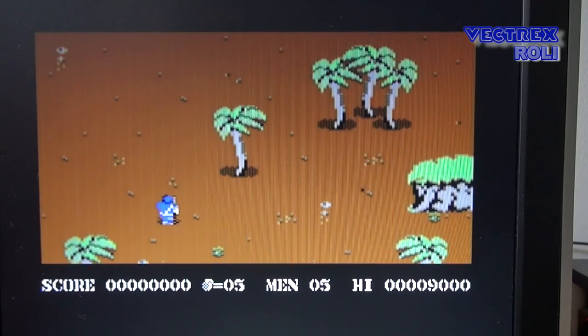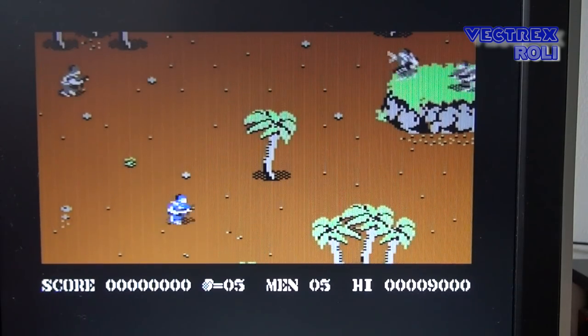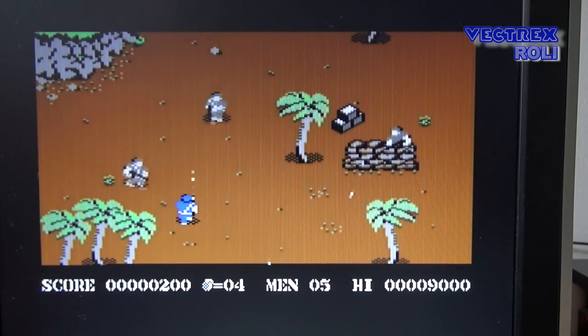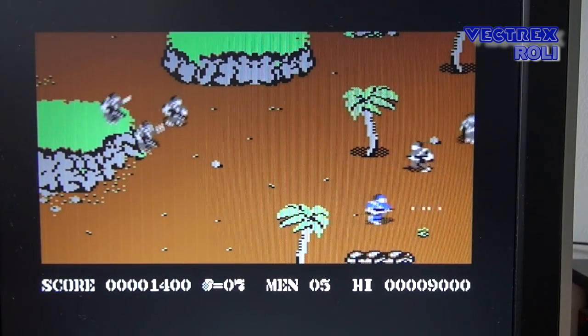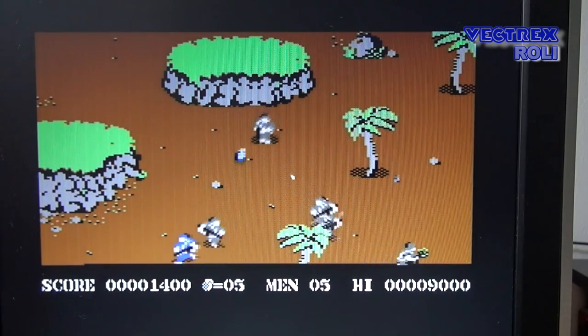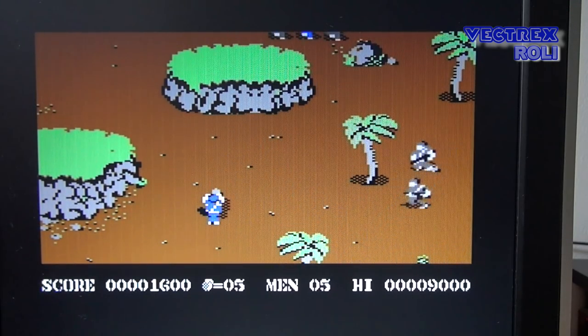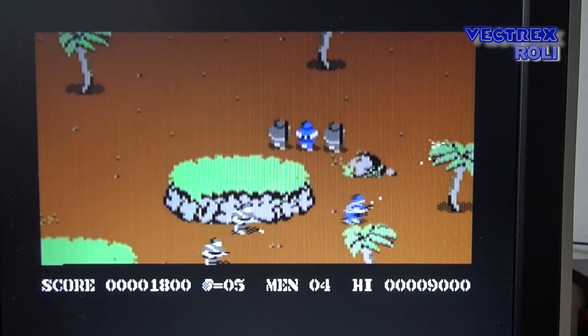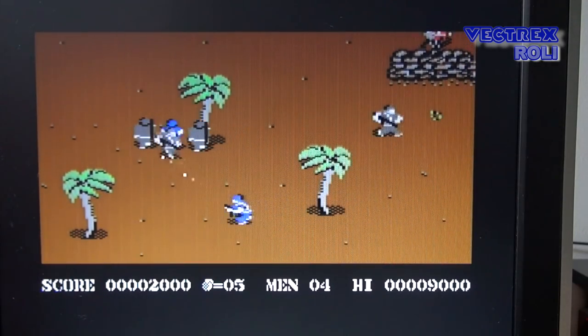If you want to use your C128 in C64 mode most of the time, it is a good idea to select any of the C64 cartridges built in your Ultimate, like Retro Replay, Final Cartridge 3 or Action Replay for example, so whenever you switch on your computer, it will go into C64 mode automatically.